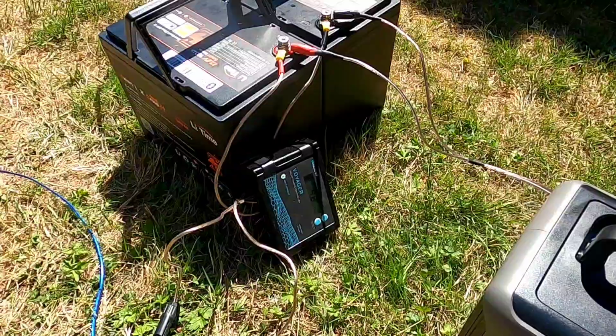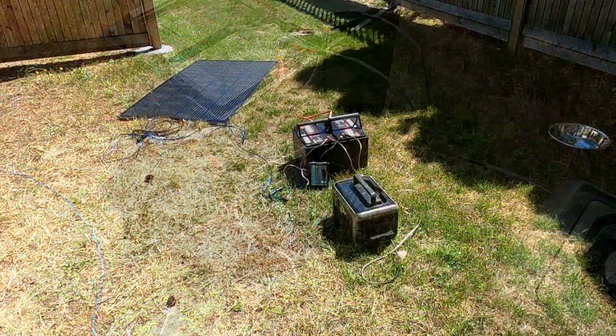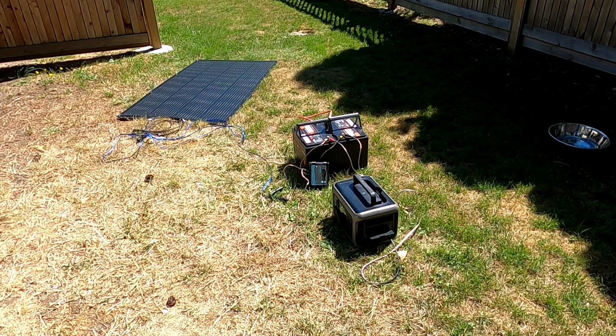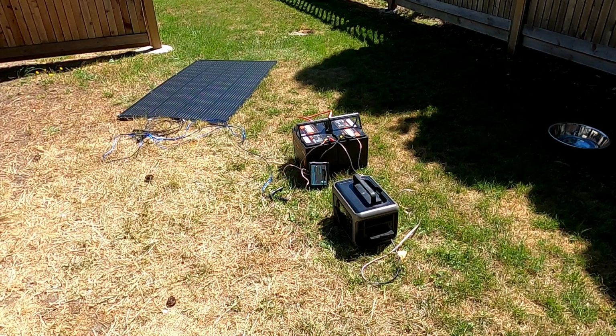So now, I'll just shift my camera angle back and discuss this setup, yeah? All right, so as you can see, there wasn't a super complex setup to get this wired together, yeah? What this allows now is I have a solar generator system running at 24 volts based off of those batteries, which means the wire diameter can be less, because the higher the voltage you draw, the fewer amps you have to pass through those wires to reach the same levels of power.